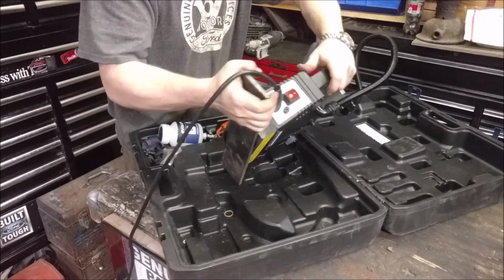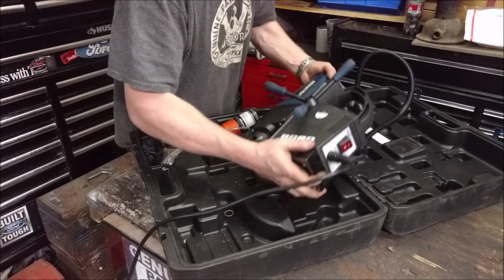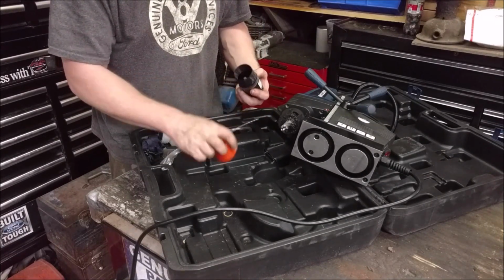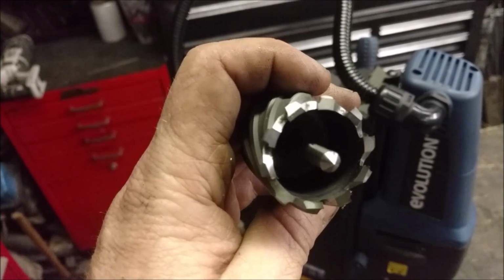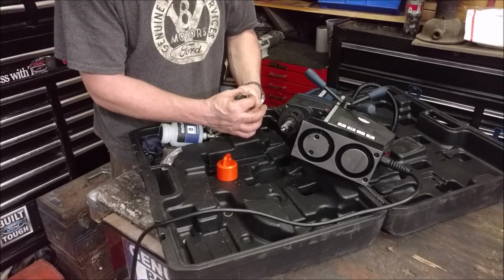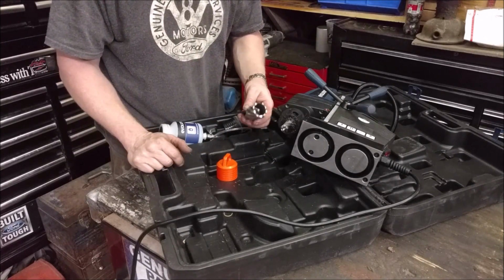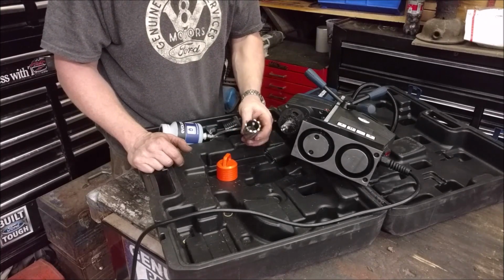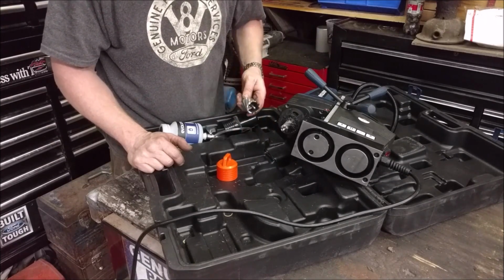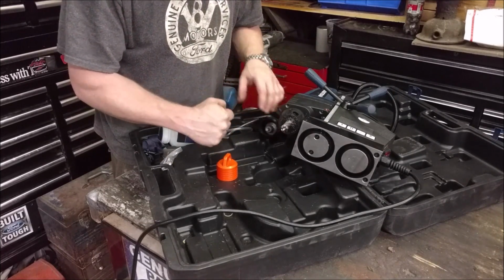That's impressive. But besides that, one thing that a mag drill can do is use annular cutters, and those are amazing. Here's a 1.5 inch. To drill a 1.5 inch hole with a hole saw and a hand drill through 1/2 inch plate takes an age. This thing cuts through it like it's butter in 30 seconds or so, and it's just right through. Doesn't even faze it. The metal doesn't even get hot. With a drill, your forearms are getting a workout as you press.